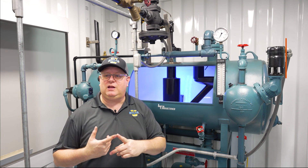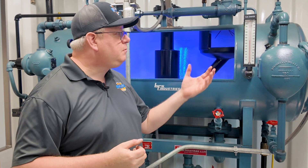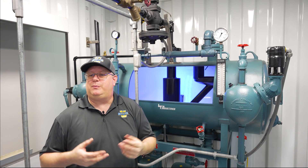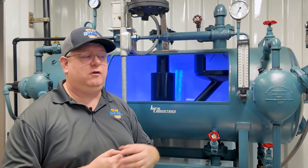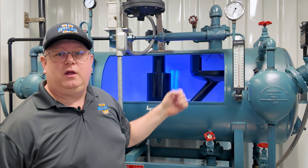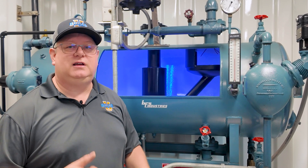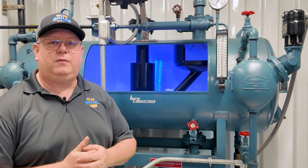So we're going to do those basic checks. Are we maintaining pressure even when we're making up high volumes of water? Is our spray nozzle intact? Things like that. There's a lot going on in here, and if we don't take the opportunity when we get a chance to pop a manway and look in there, we don't even know what it's supposed to look like. We could have upset trays in a tray-type deaerator, we could have a spray nozzle issue, we could have this thing rust a hole in it and fall apart. The internals aren't obvious on the outside of a deaerator, and if we never look at them, we don't know what we're looking at when we open it. So if we can get a chance, take it — and then we've got a better position to troubleshoot from in the future.